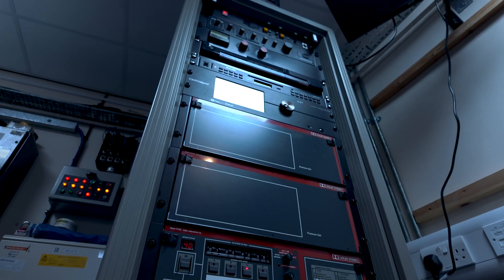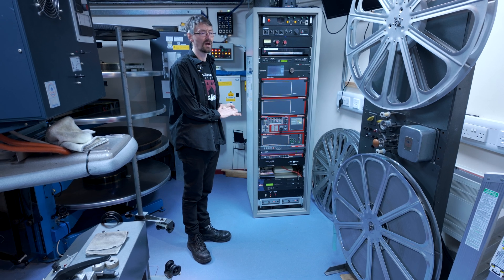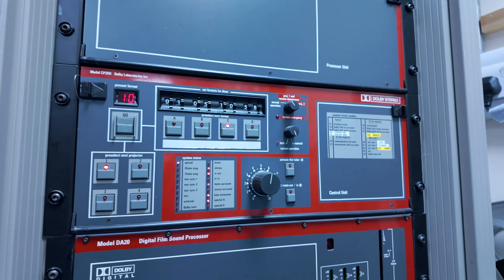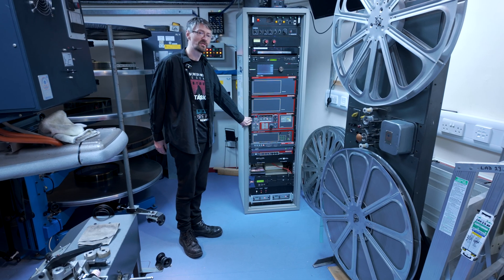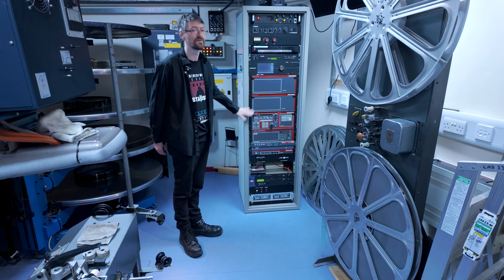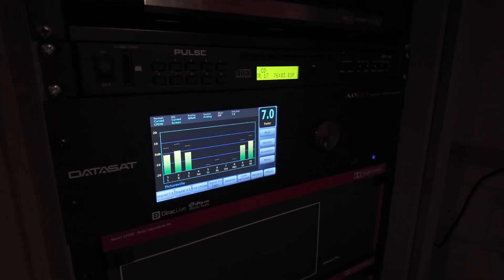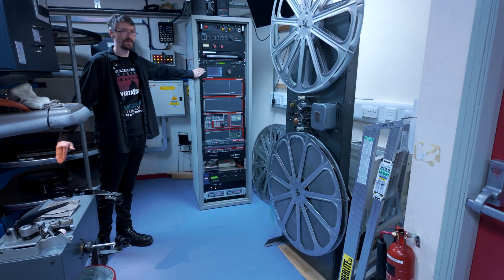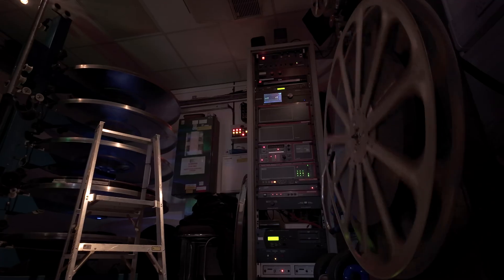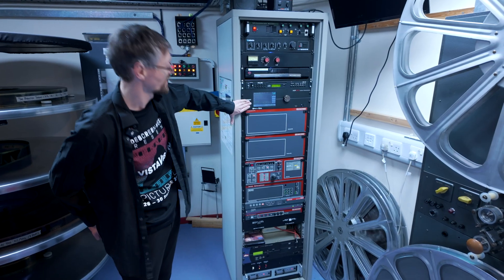We have two processors — modern digital equipment and legacy analog equipment for older formats. Modern film processors stopped supporting magnetic audio quite a long time ago, so this is a CP200 Dolby processor, which is quite old. Processors go up to the CP650, but your CP500 and CP650 won't do magnetic. So a lot of cinemas that have 70mm keep a legacy processor that can still do magnetic. Above that we have our modern processor, the Datasat AP20, which handles all the audio from the digital projector and also contains the EQ for the theater. The EQ in the legacy processor was flatlined to zero, and all the EQ is done in the modern one — that's generally how most cinemas handle it in the digital era.